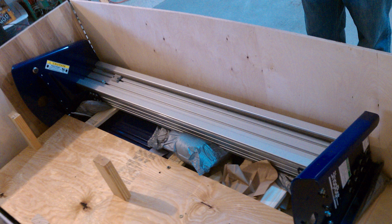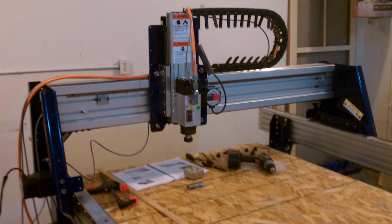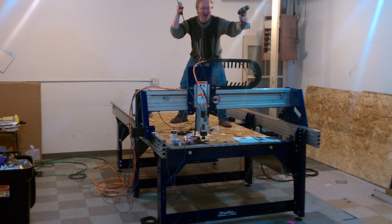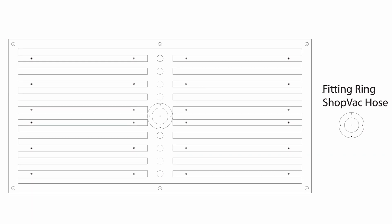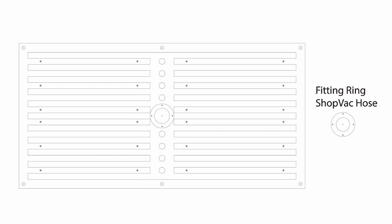That's like 300 pounds. So then we set it up in the old shop on the somewhat unlevel floor, although we adjusted the feet to accommodate for that. And then we gave it a surface of plywood, which was attached with bolts to the main steel frame. Then on top of that plywood, we put a couple layers of MDF, medium density fiberboard, which is basically particle board, aka IKEA furniture material. So that was the first iteration of the CNC machine, and then when we moved the shop in 2014, I redid it still with particle board, but I gave it a chamber, so it had a vacuum table, and that was kind of cool and all, but I very rarely used it.